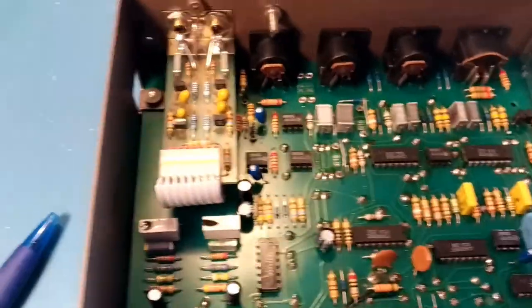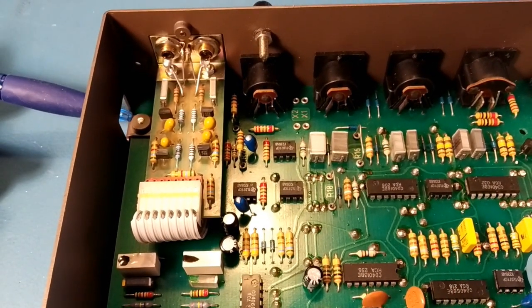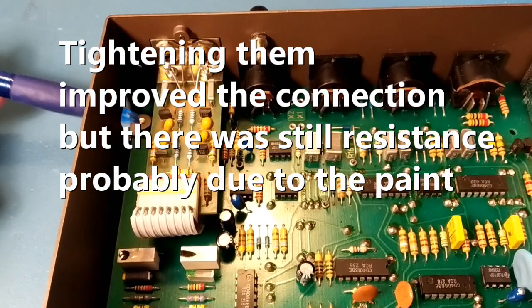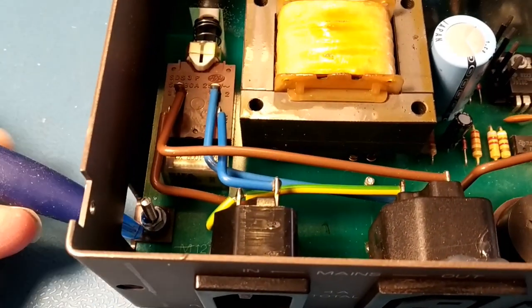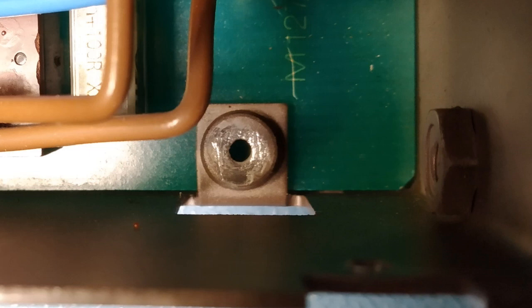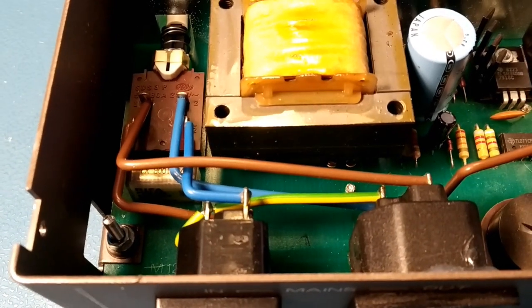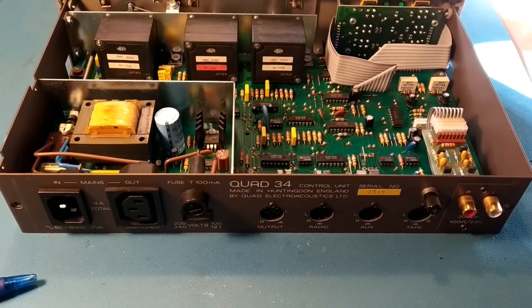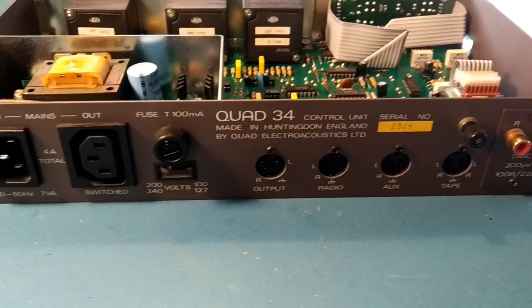It's not creating the best connection — it's relying on a connection from the pad on the back of the PCB to the metalwork of the casing through just where the screw is screwed into this metal lug. On this one, I've taken the screw out, scraped off all the paint on the top of the metal lug, then put a longer screw in with a shake-proof washer on both sides and a nut. That's now giving a nice good ground connection between the mains earth input and all the grounds on the DIN plug inputs and the earth point on the back panel.